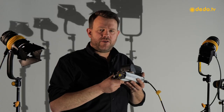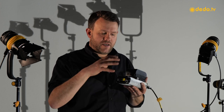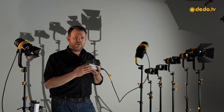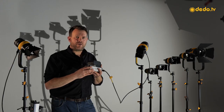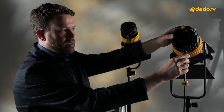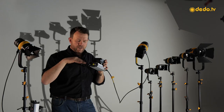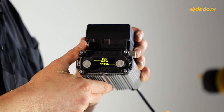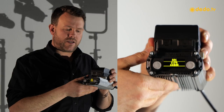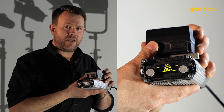Our new driver, DT NIO and DT NIO+, will drive 34 different LED light heads. The light head will be detected by the electronics, the currents will be adjusted, and the low-end dimming points will be preset. So if you start with one system, you can just add light heads according to your project and scale it up or down — which is unique.